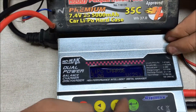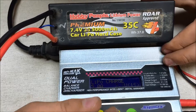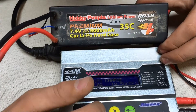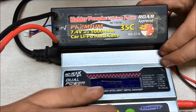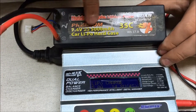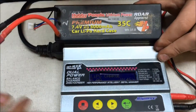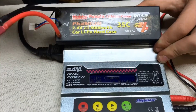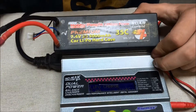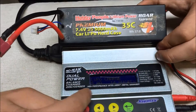To change the voltage, click it again and it should cycle through the cell options: 1 cell, 2 cell, 3 cell, 4 cell, and actually there is a 5 cell too. So you just have to choose your cells. You can often know by what it says on the battery label — a lot of times it'll say — though this one is scratched out. But you can always tell by the voltage: 7.4V means 2 cells, 11V means 3 cells, and so on. That's how you set the values on the screen.